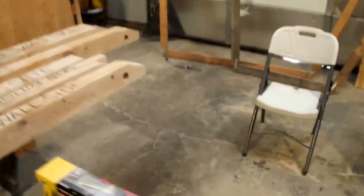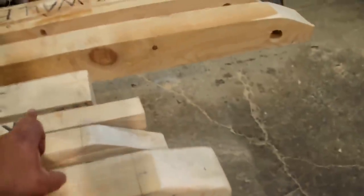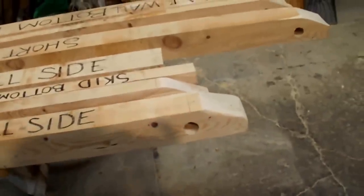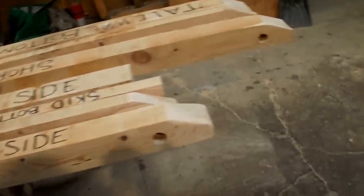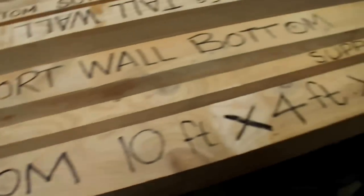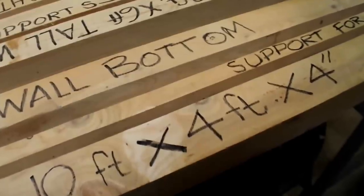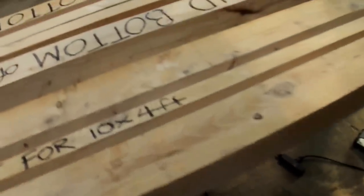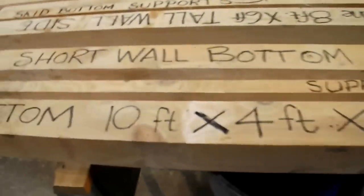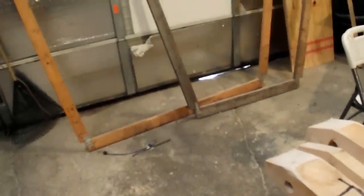At this end I have made an angle on each one of the skids, so when you're dragging it along for delivery to people, it won't dig into the earth, ground, or gravel. On a 10-foot, it's 4 feet wide and 10 feet long, and it's a 4-inch utility pole fashioned out from the sawmill. I finished it up by putting angles to match the sides of the frames.